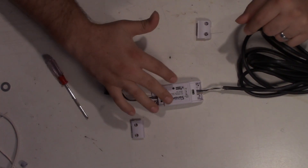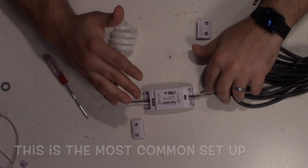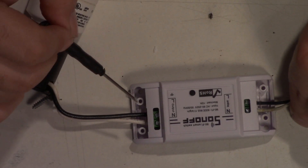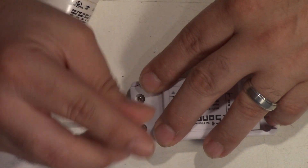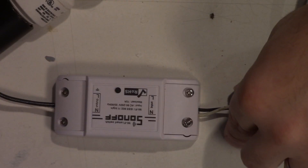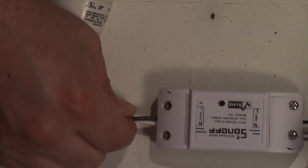So here we are on the workbench. I got my Sonoff with a regular plug connected to it — this is what I had laying around. As you can see, you got the neutral wire, which is the white — check your stuff before you figure out which one the neutral is. The load wire is black. These are your clamps; you just tighten them down right in there and that tightens up the wire for your neutral and your load. Once you put those in, you take this cover with the screws and put it right on. Now that's nice and tight — there's little teeth right there that hold the plate, and teeth on this side too that hold the wires down.